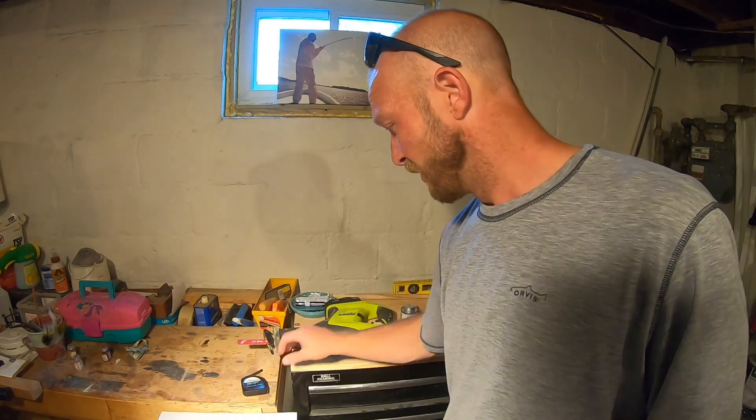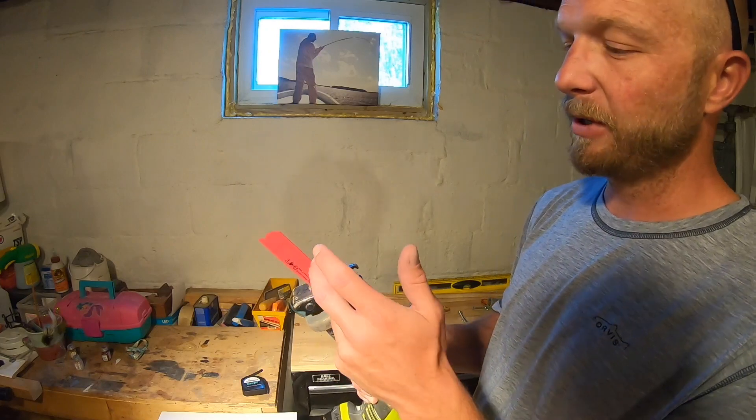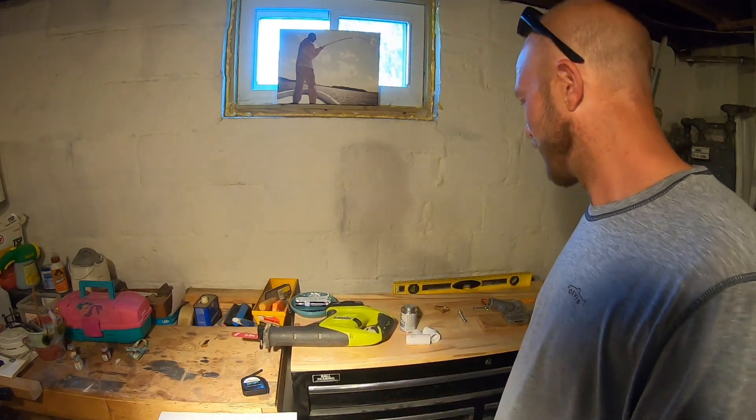The tools you're going to need: a measuring tape and some sort of saw. I'm going to use my reciprocating saw, and if you use a reciprocating saw I recommend using a metal blade instead of a wood bit — the wood bit tends to jag and rock the PVC as you're cutting it.